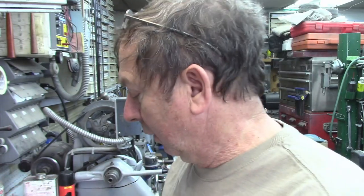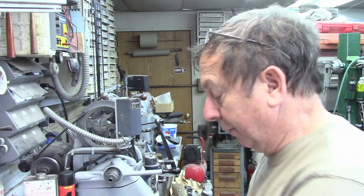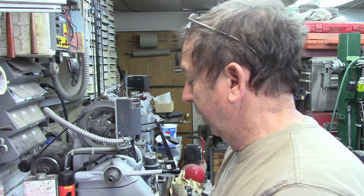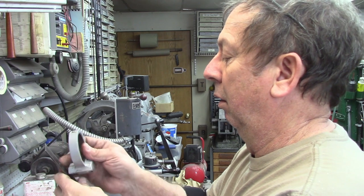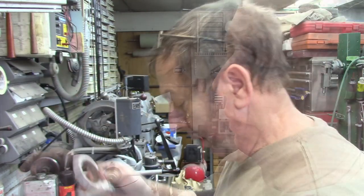There's the detent ball and the spring. I would speculate, although I don't know for certain, if we look at the detent ball and spring — there's our spring, it's going to be used on something else, a typical Atlas universal design thing. It looks like that's probably about a 45-degree angle off of the base. Yeah, we're at 45 degrees, so each of our detents is halfway between. Pretty simple design — we'll make up a casting pattern for that one and produce a few of these.